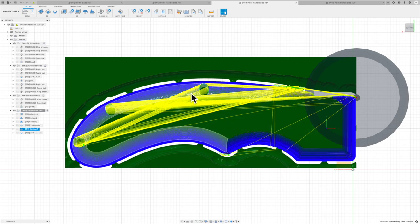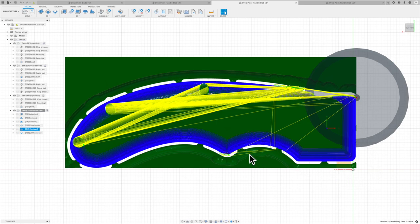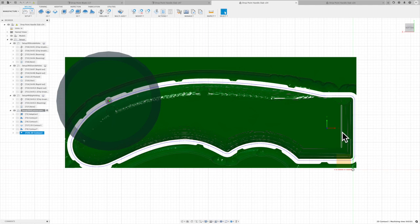I'll machine it this way first time to see how it works, then look at the cleaned-up design later. I also had a lot of learning figuring out how to cut the piece out — first I tried the tabs feature, but in titanium with small bits it didn't like the up-and-down plunging and I broke a couple of bits. Getting my speeds and feeds right for profiling this material slowed me down a bit.